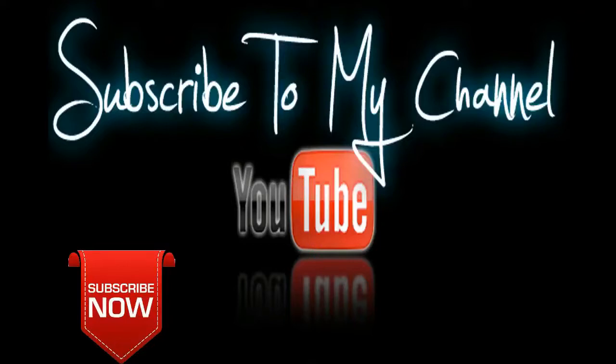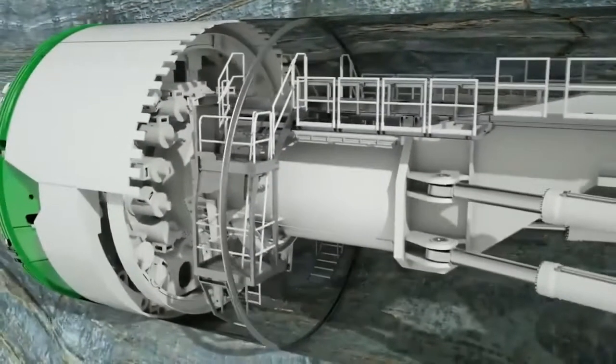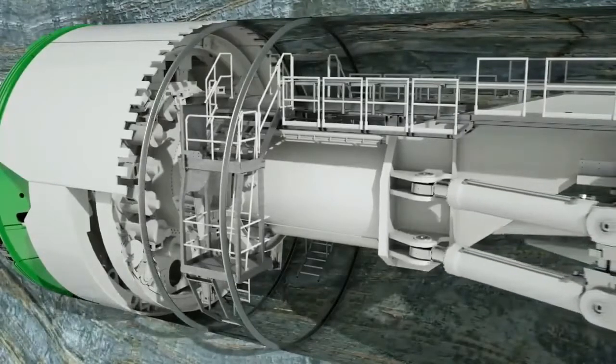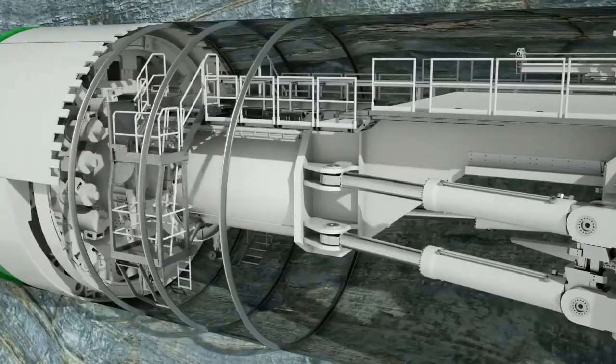The complete ring is then moved to the installation position, braced against the rock and mounted. Depending on the geology, rigid or flexible ring beams are used. The rock condition, with its geological and geotechnical characteristics, is decisive for the type and extent of rock support. In addition to the boring process, rock support is the key factor for the advance rate of the TBM.